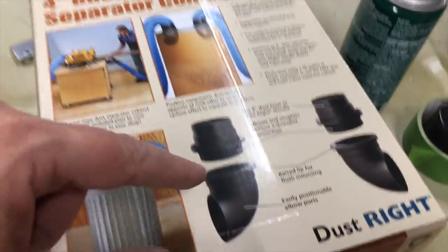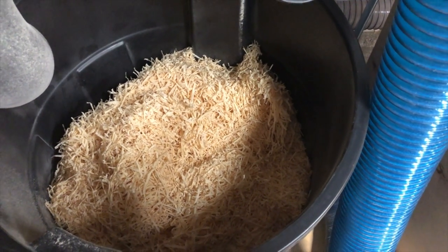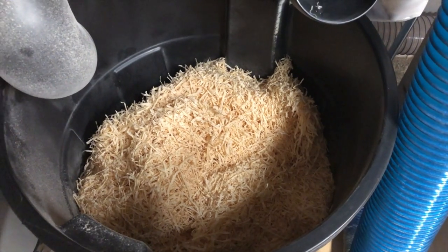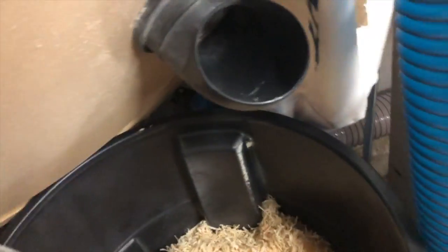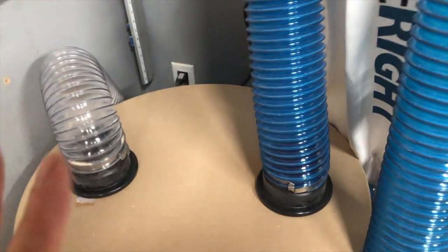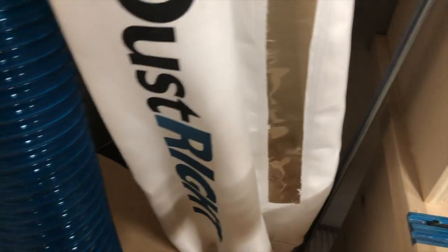The little Rockler kit comes in two pieces — they just screw together in the hole you make, so you don't have to silicone or glue anything. Here's the inside after using this for maybe a week and a half. That's a lot of planer shavings in there — that's going to become mulch in my garden. You can see one 90 going that way, the other 90 going the other way, and it works quite well. On the CNC I also had it carve out a groove that fits right around the rim of the trash can, though in hindsight you might not even need that because the suction really pulls the lid down.